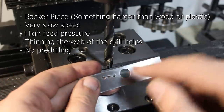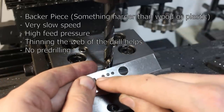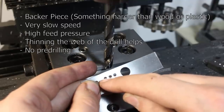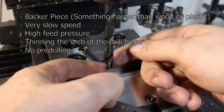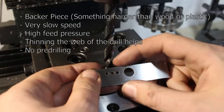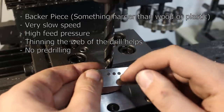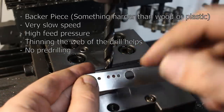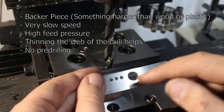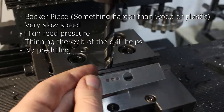When the cutting edge of the drill hits the edge of your pre-drilled hole, it puts a lot of point stress on the cutting edge and will wear a deep gash into it. At some point it will just stop drilling. So don't do that — drill straight to the final diameter.